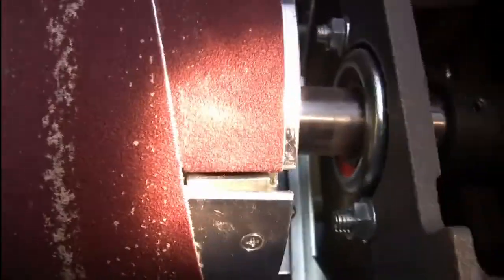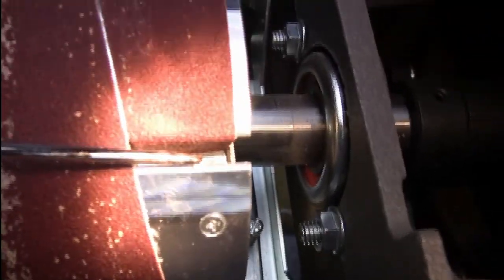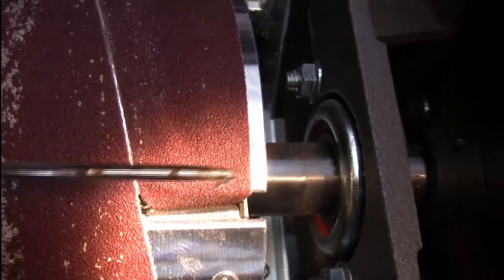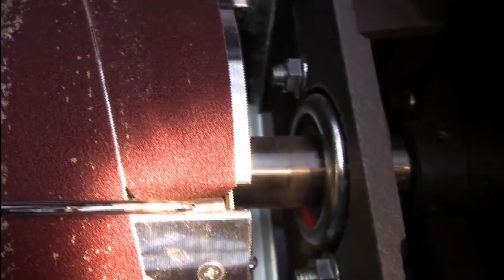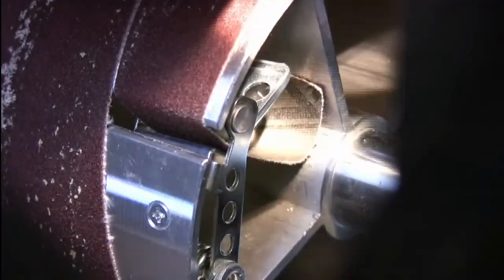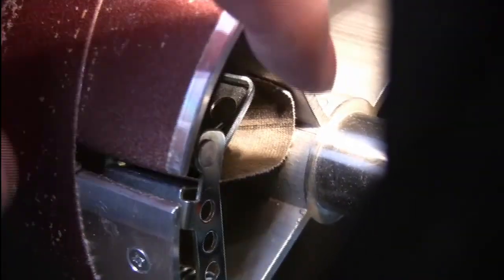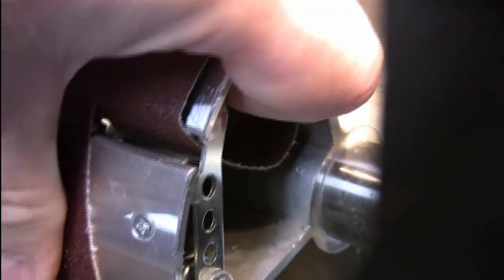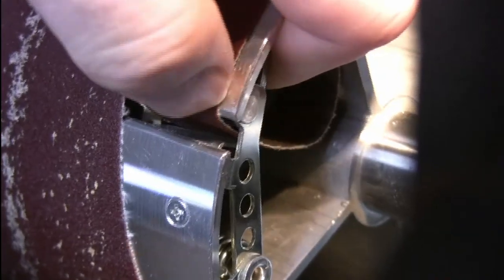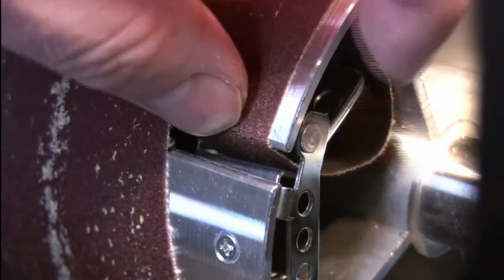With this tilted down and coming up you can see this metal piece — that clip — the sandpaper has to go right next to that, straight down. From the bottom coming up, if it's not going right next to there straight down, you can see it going down that way. There's that metal piece that the sandpaper has to go right next to. If I hold this tight and pull the clip up, you can see the sandpaper goes right down there past that metal clip, and when you clamp it, it grabs and pulls the sandpaper down tight.